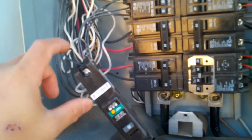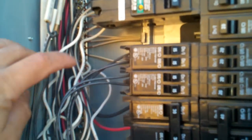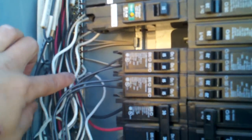I've got my replacement kind of wired back in. I've got the ground going to the ground bar in the back, the white in the back, and the black in the front — just like the others are wired and just how I removed it. I'm going to try and snap this back in. The left side kind of tips in first, and then the right side will snap in. Grabbing it again — front goes in and then I snap the back in.